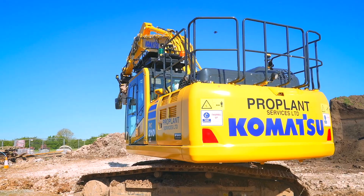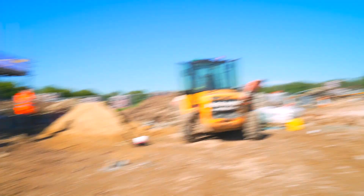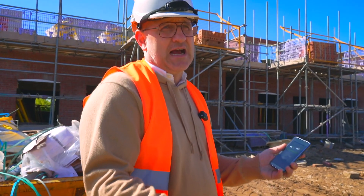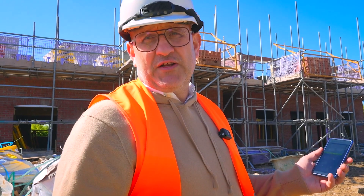I can pick the line here — hold on — go polyline steer toe, and now it tells me how far off that line. You can even have a 3D line, dig to the height of the line surface. With plots it'll dig position to a line position and offset to a line. You can dig to a surface, to a grade, to a plane. You can even draw sections on a line — so for battered areas you've normally got a 2D line with just a level; you put the line at the level, pick it, and say dig me to a bank of one in three. It's much easier than doing models all the time.